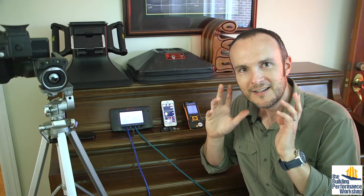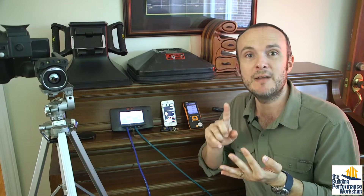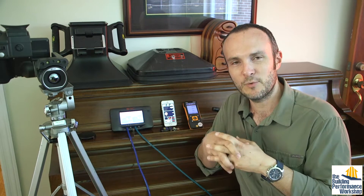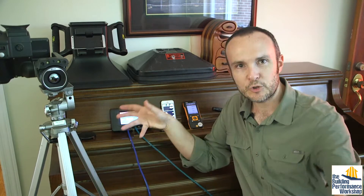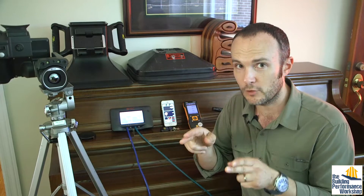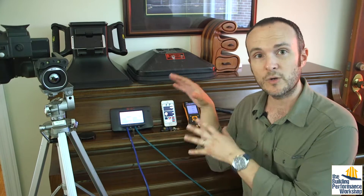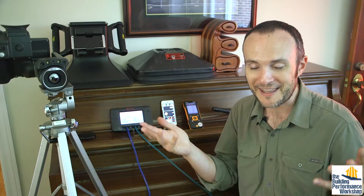The first thing we've always done before any diagnostics is get the homeowner's wants and needs. In this case we've got my mom and dad. My dad likes to have utter control over every thermostat. My mom has cold feet — she's now taken to wearing two to four pairs of socks every day — so we want to make this floor warmer. Temperature evenness across the house is the end goal. Just going in and air sealing because air sealing is good is the wrong approach every single time.